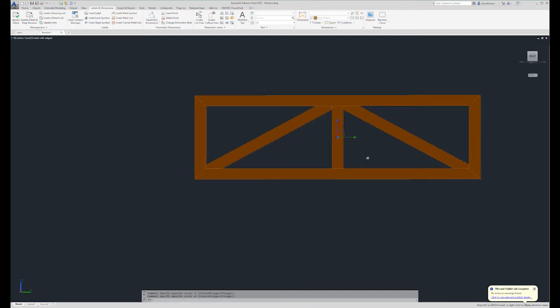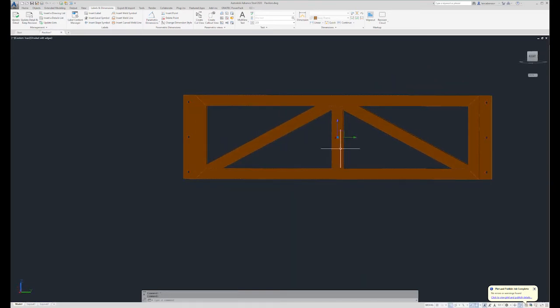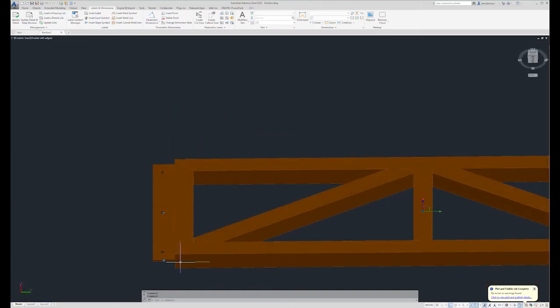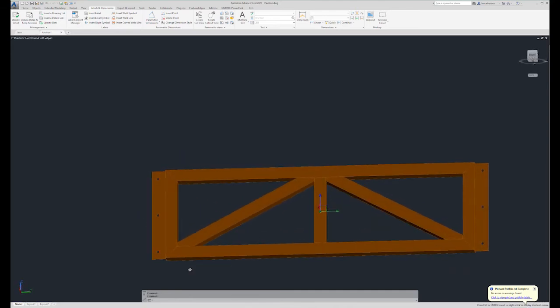phase 4, I'm going to drop my diagonals in, and then I have a tube steel frame all tacked up, and then I'm going to use flat bar and clamps to create a jig, and I'm going to build my remaining 7 sway frames on top of this assembly, because I have just created a fixture for the rest of them. The last thing I'm going to do is go back and add my accessory shear tabs to the end of my frame. In our shop we have special spacers with flat bars we would clamp on our tube steel frame that would set the elevation correctly for the shear tab. We'd tack it, then we would weld out the assembly, clean them up, get them ready for paint.